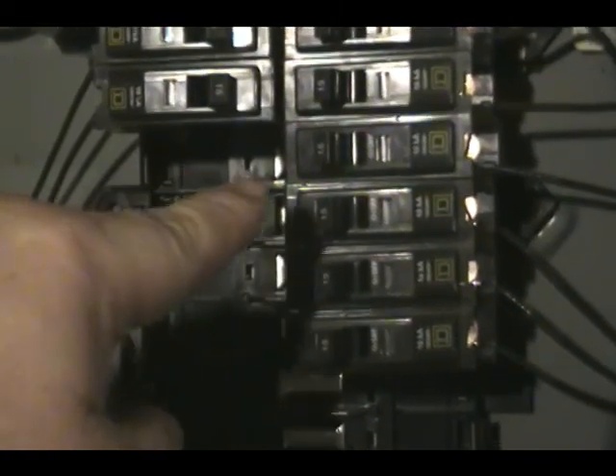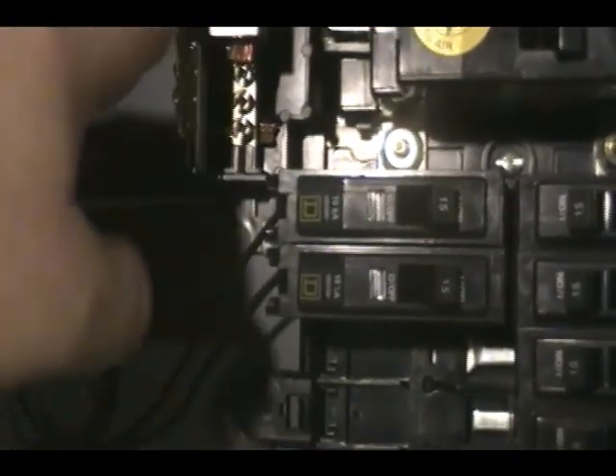What I'm going to do now is take this black wire and run it up and attach it to the circuit breaker. I'm going to run the white wire nicely along here and back into my neutral bar. Then I'll come the other way and run my ground — or my neutral and ground, it doesn't matter which bar you use — you can hook them up either way and that should pass code.